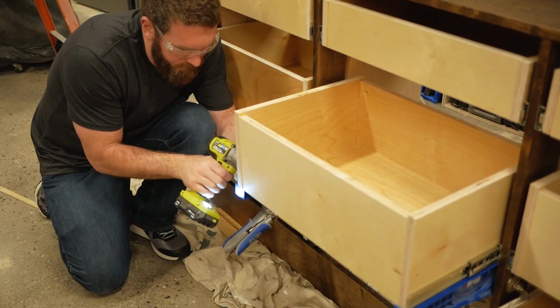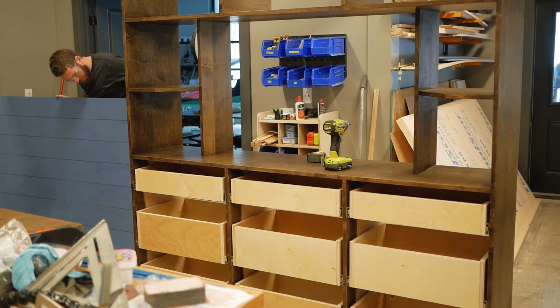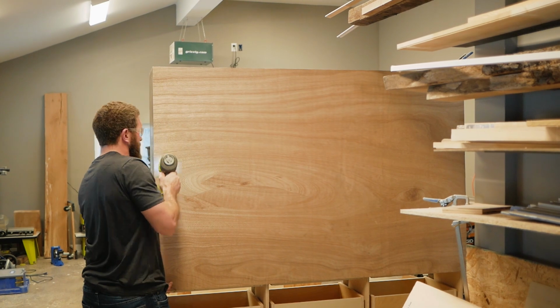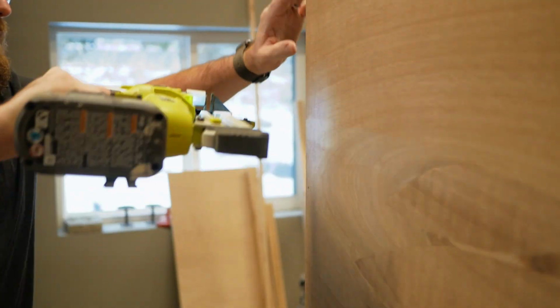We went with an inexpensive, faux shiplap look, and we used 1/4" plywood, and I made passes on the table saw spaced 6 inches apart. Then Jamie came back and gave it a couple coats of blue paint for a nice look.